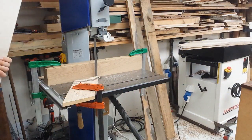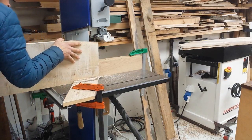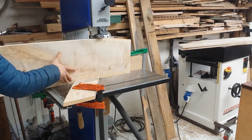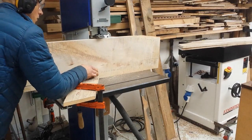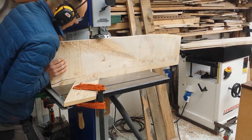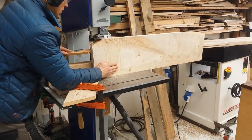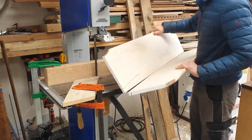Ultimately there's a lot you can do to improve these steel framed bandsaws and I quite like them for what they are, but they sure do take some tweaking to get working well — which does beg the question of whether the Woodgear-style wooden bandsaw is really the way to go. I'll leave that as an open question. One thing I'd be negligent not to mention is the blade itself — how sharp it is makes a humongous difference to how well you cut and whether you get blade drift. I hope you got something interesting out of it — thanks for your company, please share and subscribe.